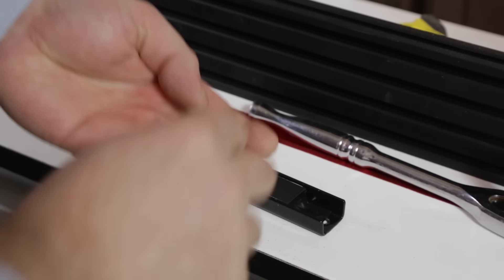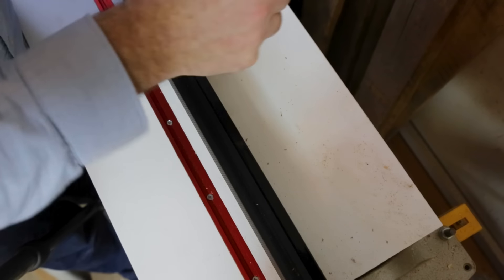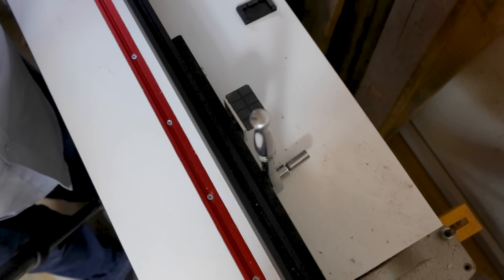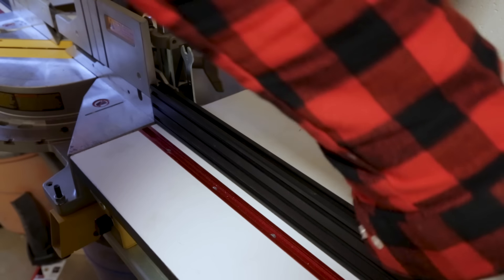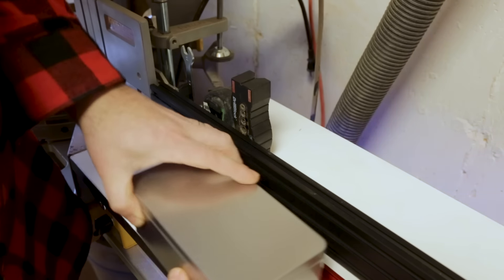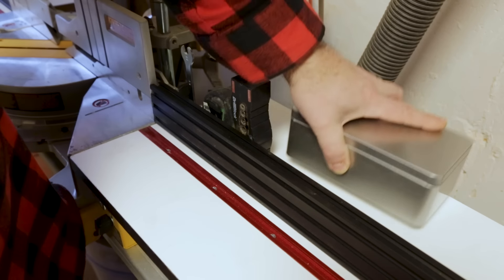On the back of the auxiliary fence I added these magnetic tool holders, which screwed on to the track using the M5 bolts for the series 20 extrusion. They gave me a great place to attach loose accessories and hardware while working at the station, and it's also where I attach tools I use a lot on projects so they don't get lost. This is really great if you're on location and don't want to drop things in the grass. I even got a little tin case to hold all my knickknacks and accessory parts, and this attaches to the back of the magnets without falling off.